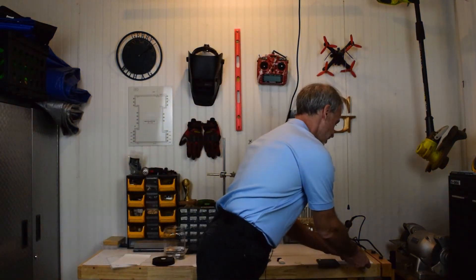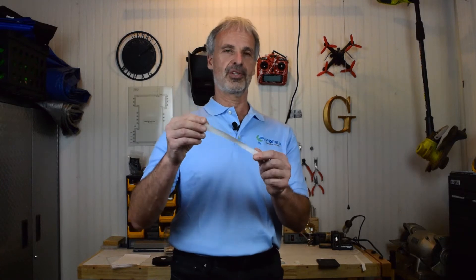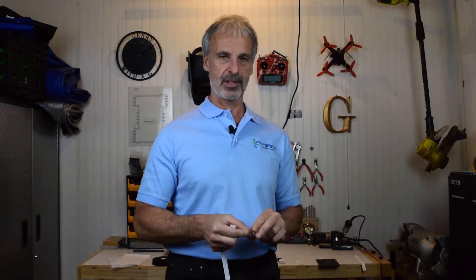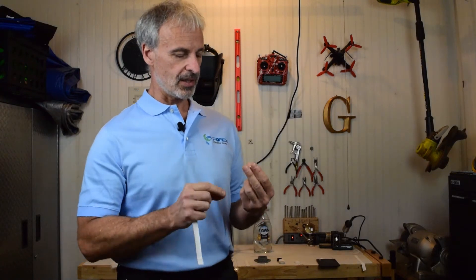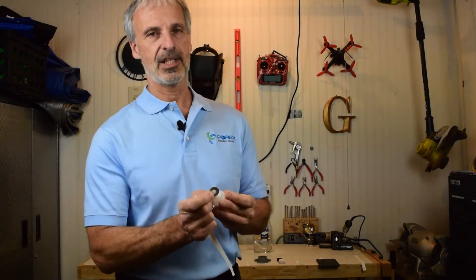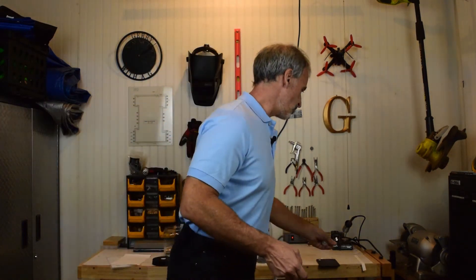The first joining technique we'll talk about today is ultrasonic or heat staking. Ultrasonic welding is probably the most common way to join Porex Vertec PTFE to its host product. You start off with a strip or typically a roll of PTFE cut to slightly larger than the width of the vent that you need, then it goes through a piece of equipment called an ultrasonic welder, and you get a bond to your finished product. Here's one example, and here is a second example of an ultrasonic weld to a finished part. This short video will show the ultrasonic process.